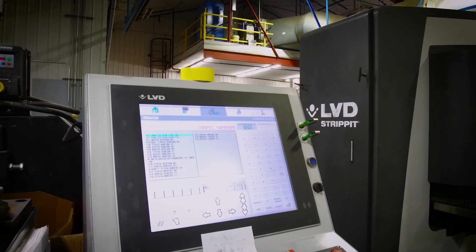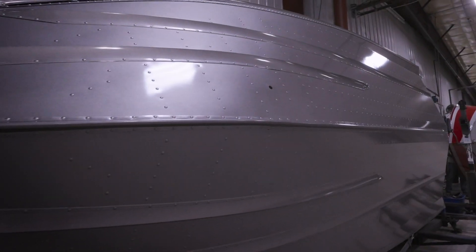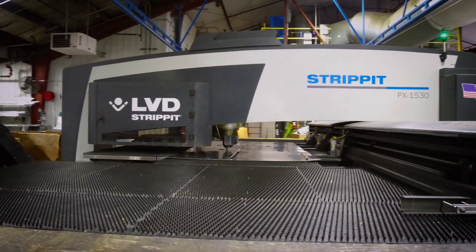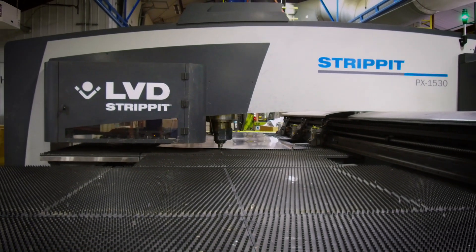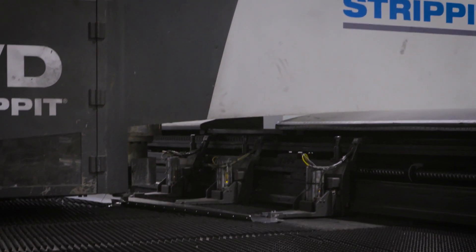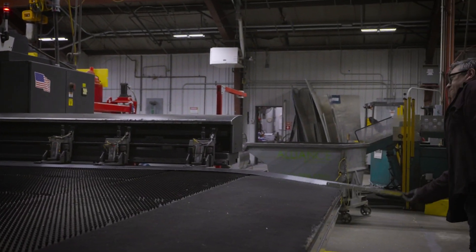The turret is one of the coolest machines we have in PartsFab. It's responsible for adding a curved flange on a lot of our aluminum parts. On a deep V boat, as you travel forward, that bottom running surface becomes more and more curved. We want to add internal structure to all of it, so the turret adds that flange around a curve, which on a traditional press brake would take hundreds of hits. The turret works by manipulating a sheet of aluminum with three different fingers, grabbing that sheet and manipulating it under a tool head to add that curved flange step by step.